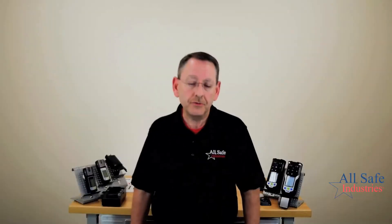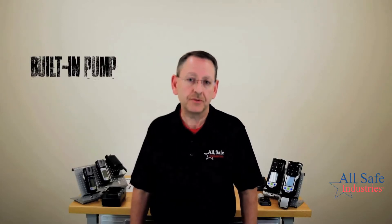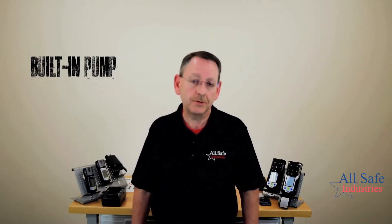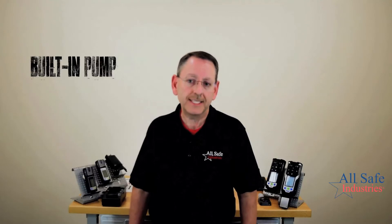As we begin talking about the new XAM 3500 and the XAM 8000 from Draeger, they both share some unique new features. That includes a built-in sampling pump, and what's really cool about this built-in sampling pump is it has a pump cap that attaches to the front of the instrument. There's a small magnet in there that activates the pump. If you remove that pump cap, you can actually run the meter in diffusion mode — so you have an instrument that can be both diffusion and pumped depending on what you're doing that day.